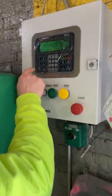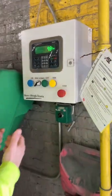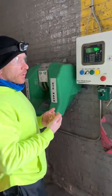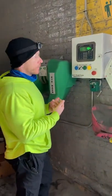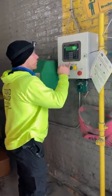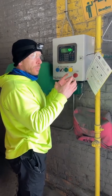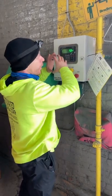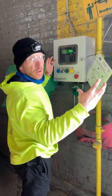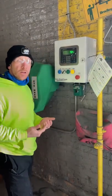Target weight set. As the pump is engaged, it's going to pull the weight off the scale by pumping out of the drum on top of the scale. Once it hits that point, the set point shuts off. The way we have the display set up, it's going to show the actual total weight pulled off the scale in a positive sense, even though it's actually coming off the scale in a negative way — so it's inverted.